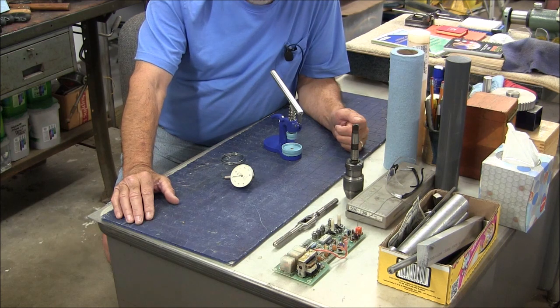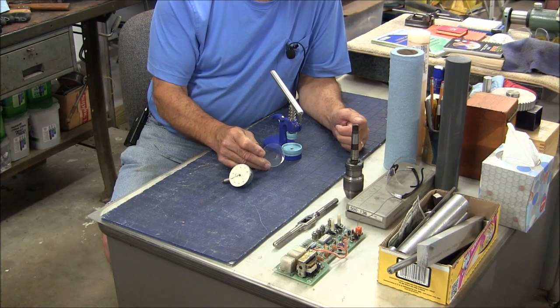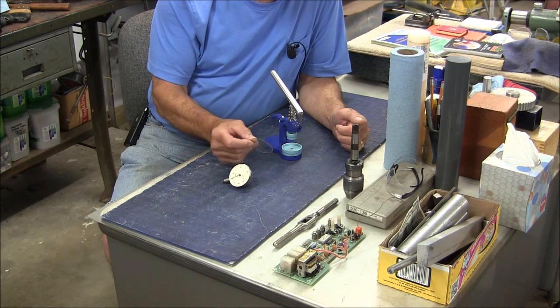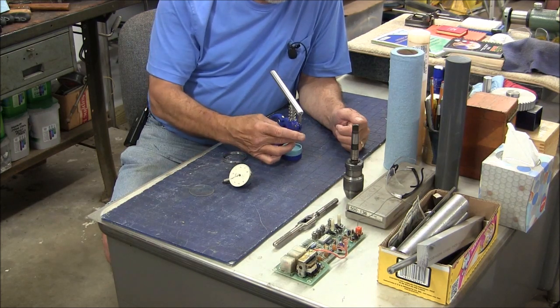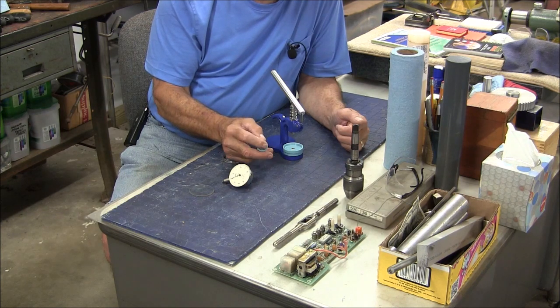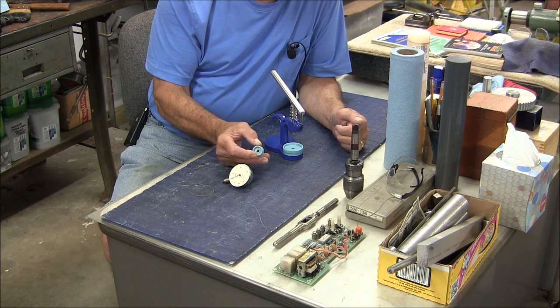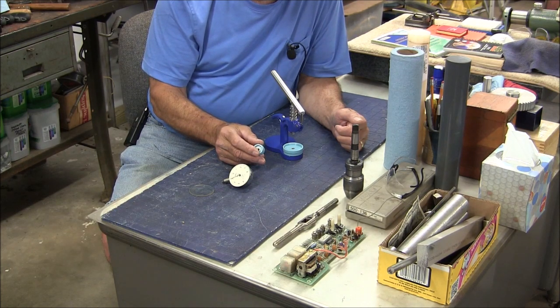This is the first polycarbonate that I did. You probably can't see from where you're at, but using the dies that came with my little crystal press, we've got some big mars or dents in these things. That leads me to believe I have the wrong dies. The upper die is just a disc with a bowl shape - from looking at YouTube, the successful ones are more of a dome shape, which spreads the load created by the pressure.